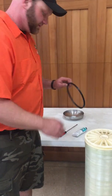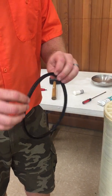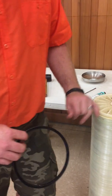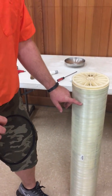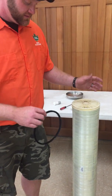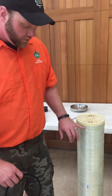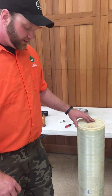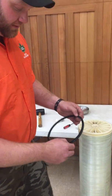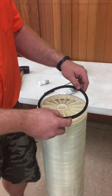The first thing we're going to do is take our U-cup. Our U-cup is basically a grooved O-ring that has a V-channel on one side and is flat on the other side. On CDL RO machines, a lot of membranes will have a directional flow arrow drawn on them. This particular membrane doesn't have that arrow, and in this circumstance it doesn't matter which way the directional arrow points. The one thing you do want to do is make note which side you have on top and which side you have on bottom year to year, and try to rotate those. So we're going to put our U-cup on with the grooved side facing up.